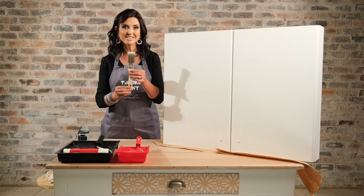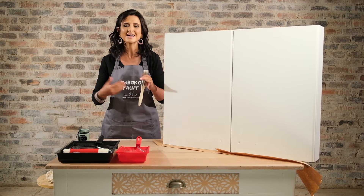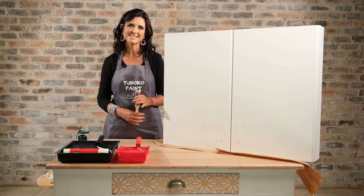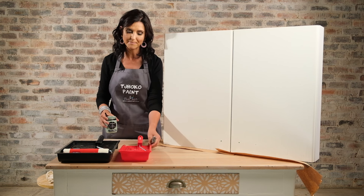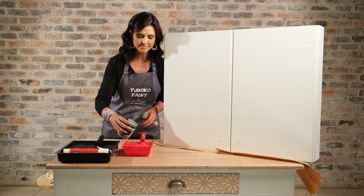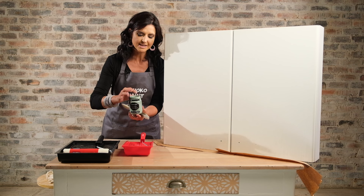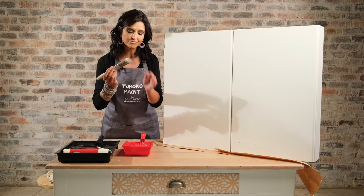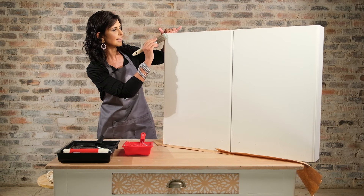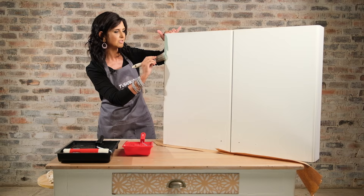I'm going to start with cut lines. Cut lines are the areas where your roller can't reach — it's like colouring in a picture: you first do your cut lines and then fill the gaps in the centre. I'm going to decant my paint into a paint tray. There are a few things that contaminate paint, air being one of them, so I'm just going to decant as I need and close my bottle for later use. I dip my clean dry paint brush in the paint and start painting cut lines. Masking tape can be used on areas where you don't want any paint to reach.